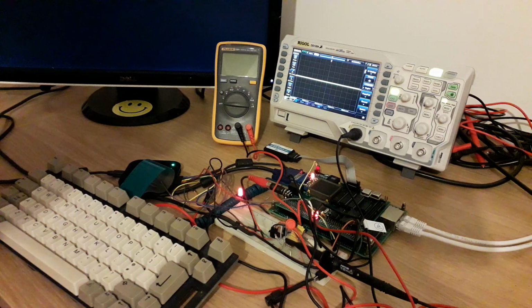So the keyboard is an AVR controller running some firmware I wrote a while back. The AVR is an ATmega8515, which is one of the reasons you have to use that sort of part in AVR based keyboard controllers: you need lots of I/O, especially on the Amiga keyboard anyway. So pretty much every single pin of those 44 pins are used.